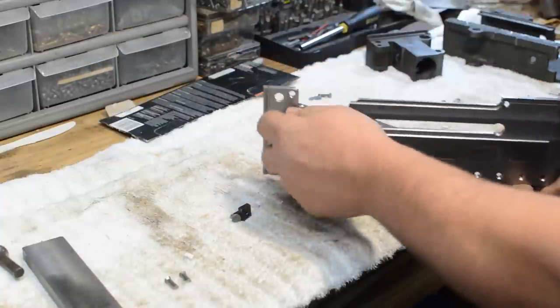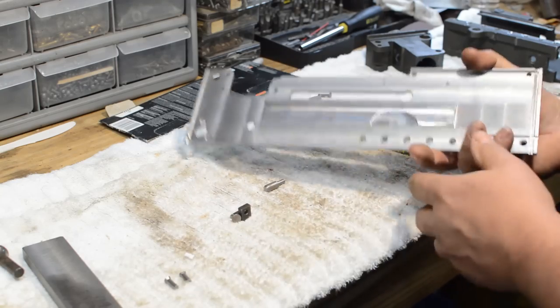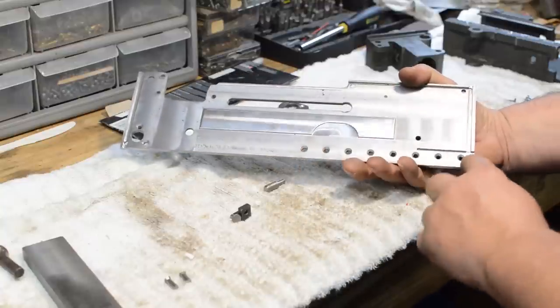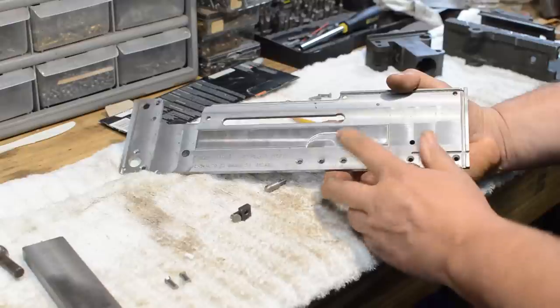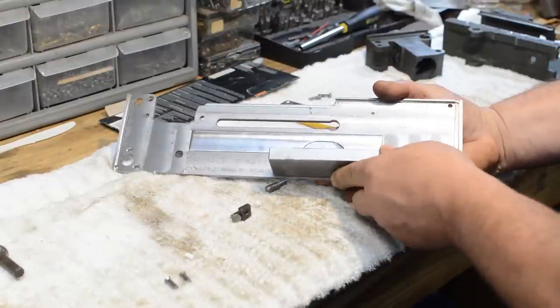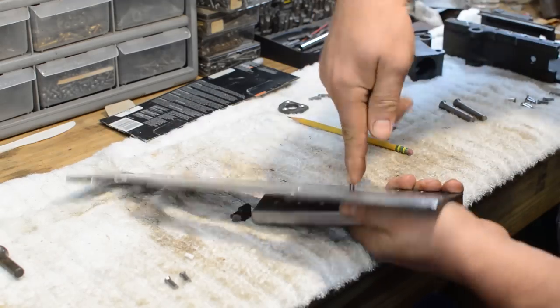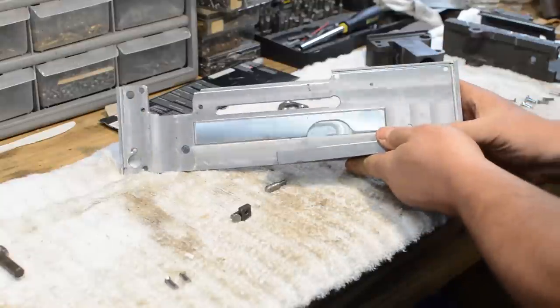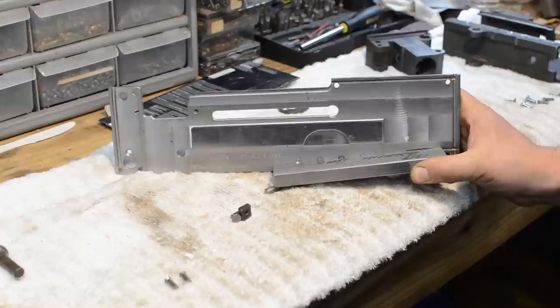So we're going to set up some fire here. We're going to do these two up on top of the vise, but when we come down to do the main rivet holes in the bottom down here that are going to hold this to the side plate, the rivet will go through. We'll set the bucking bar on top of it. What the bucking bar will do is take the load that we're applying here, take it through the bucking bar, through the other side plate into the floor, so we got something solid to hit it up against.